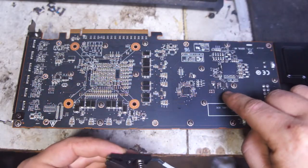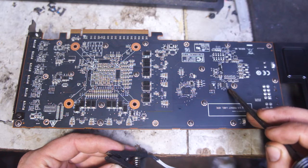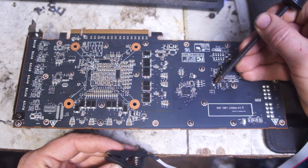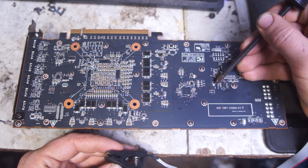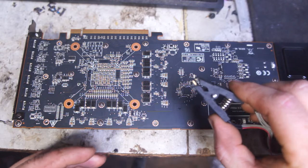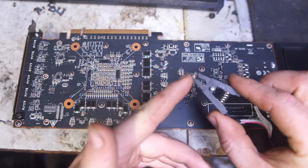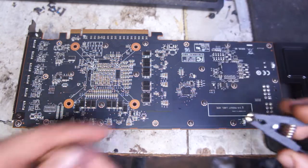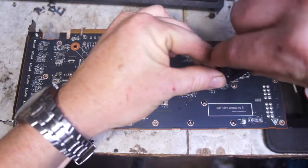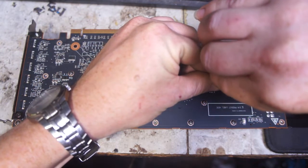On the PCB on this IC there's a little arrow pointing towards this pin — that's pin 1. On this IC there's another arrow pointing towards this corner pin — that's pin 1. Mine also seems to have a little white mark designating pin 1. Also, if you get the same cheap one I got, the end will be kind of rounded and you won't have enough clearance to get it around this chip, so I took a grinder — sandpaper would also work — to shave it down to where it's more pointed so you can actually get in there. So again: red wire, pin 1 over here — squeeze it open, get it all the way down, get your face in there, make sure you have each little metal contact lined up.